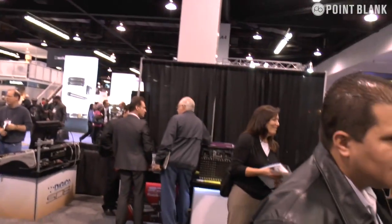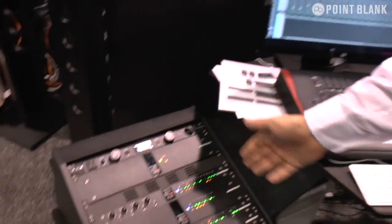That's DigiGrid. We have a new relationship with the people from Digico. You can see all these big live consoles. For three years now, we've been running plugins on live consoles — people are now starting to use plugins in live concerts, front-of-house engineers, using a dedicated system called SoundGrid. With DigiGrid, Digico decided to make studio hardware that will use Waves SoundGrid technologies for studio users and not only for live front-of-house people. SoundGrid is a processing and networking solution by Waves, including basic IOs and dedicated DSP processing power through DSP servers using Intel CPU chips. So you offload it from the CPU of your workstation.